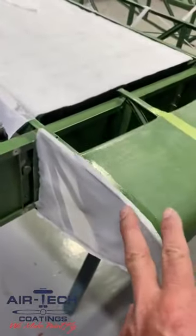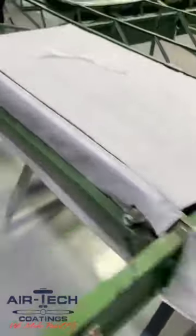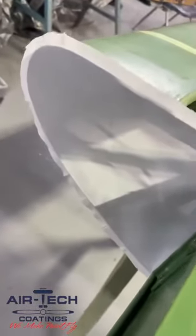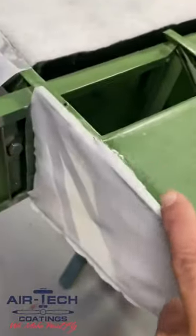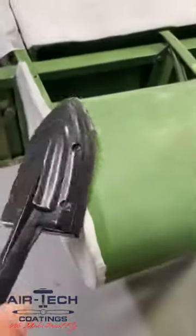And what I do on the root, I cut my piece a little big, it's just a sharp edge here. Just put a little glue all around the edge and stick it. And I think James has done that over here. Once it's stuck, then you can cut a little perimeter, maybe a 1/4 inch, and then cut some little reliefs in it. And then you can just take an iron and break that over.